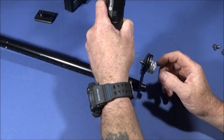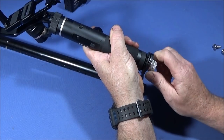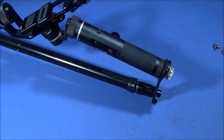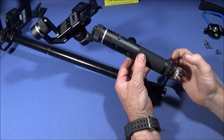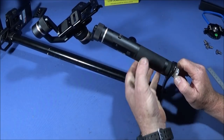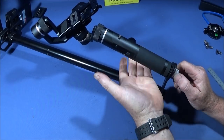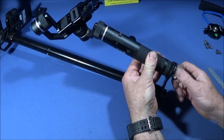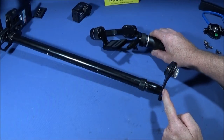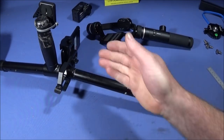And then the gimbal is simply mounted onto that screw, and having this collar makes it dead easy to actually lock up nice and tight. And that assembly there with the PVC or the Delrin and the rubber also stops the gimbal from moving about when you tighten it up. It sinks into that rubber and you can't actually twist it on the assembly easily, so it holds it nicely in place. And I found the 15 degree angle on the plate here to be just right for my use. So that's the main part finished, and next I mounted the phone on the assembly.